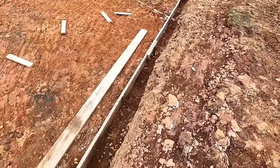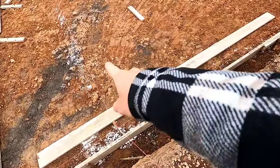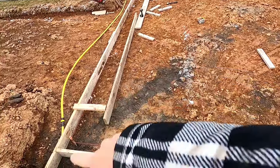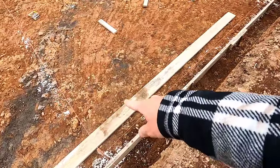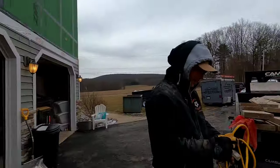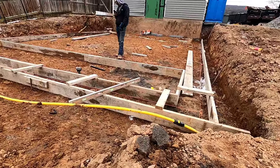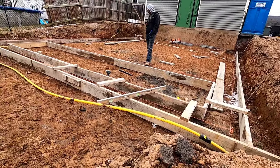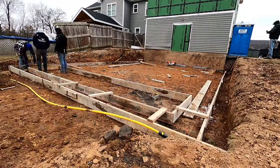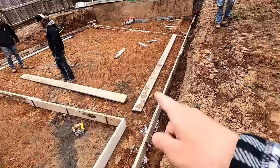Outside of the forms all the way for this addition are completed — set the height, everything. We measured off for this — this will be the basement area, this wall line's established now — and this will be a porch area. Porch will be 18 inches of footer and then this wall line will be 20 inches of footer. Got the porch all framed in, now we just gotta stake it to height. We're just gonna use the level there, level across from our outside wall outside footer board, make it level, stick it all up. Porch footers are completed — this was our only 18-inch section of footers, the rest will be 20.